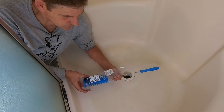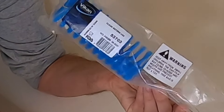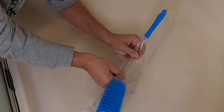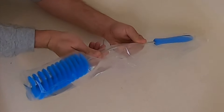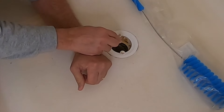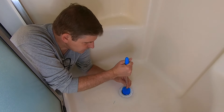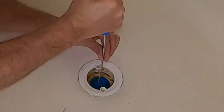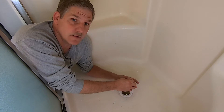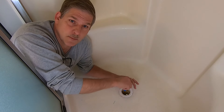We really have a two-step process, and the first part is to get a brush like this — we're Amazon Affiliates and we'll put a link in the description below. They're a little bit hard to find. This brush is two and a quarter inches across and about five or six inches long, and the most important part is it has a flexible shaft so that it'll bend once it goes into the trap area. We want to try to get it down there as far as we possibly can to get rid of all the buildup on the inside of the pipe and low into the trap. So the first thing we want to do is take our cleaning brush and put it down into the pipe and just run it up and down as you go deeper and deeper — it's scrubbing the walls of that drain. The further you can get it the better. That's the reason we bought such a long brush with a bigger diameter than the pipe, so that we're getting a good scrub as far down as possible.